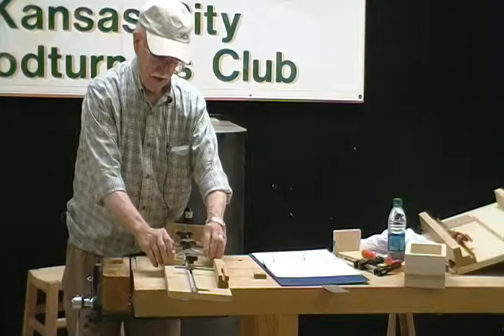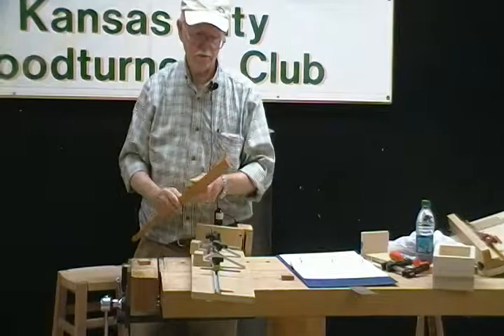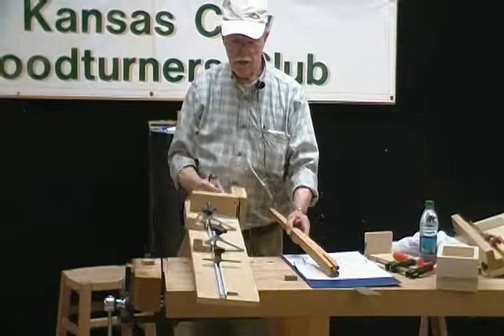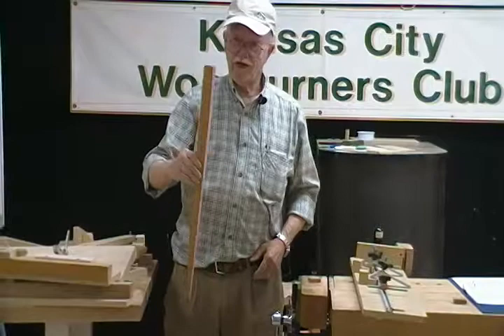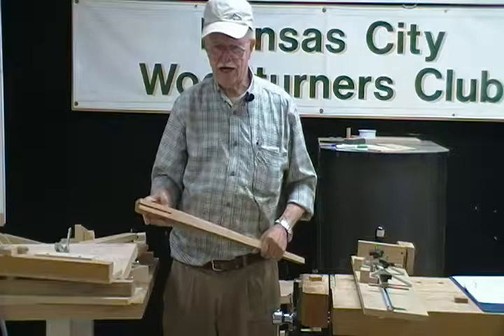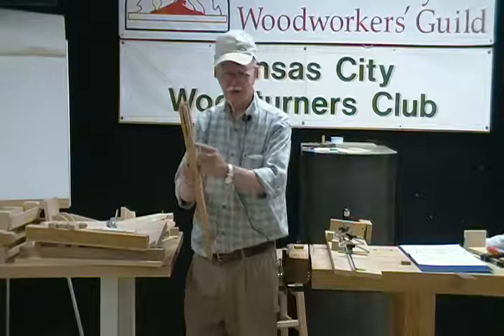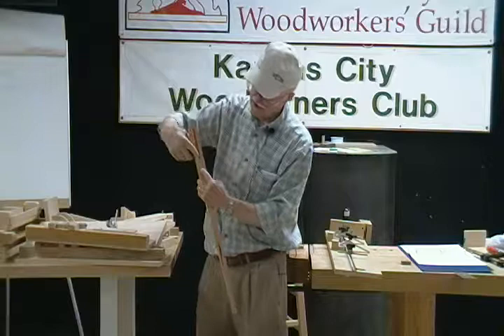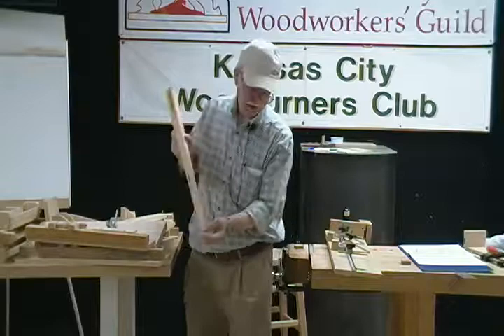This jig has adjustable stops on the taper. This is a table jig — I showed you several slides back. I've made a number of these on this exact jig. Rather than reading degrees off a plan, what you're interested in when you taper a leg is where the taper starts. If it says it starts five inches down from the top, measure that and make your mark. Look at the bottom and find out how wide it is and make a mark there.